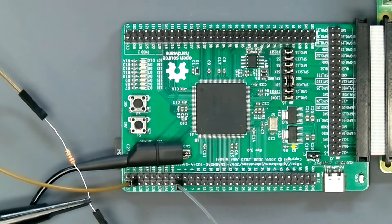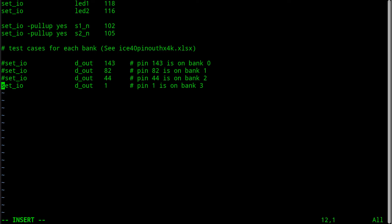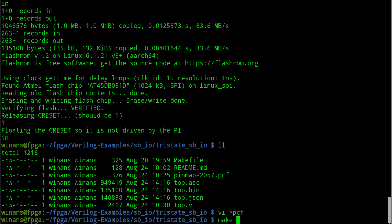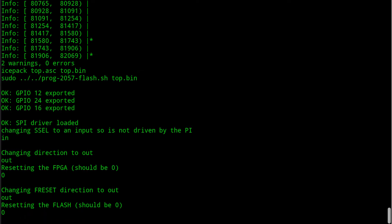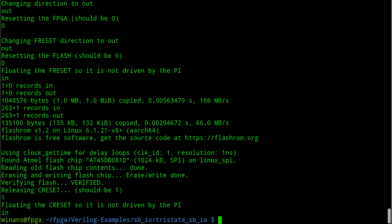But is it driving high or is it being pulled up by a resistor inside the FPGA? If I connect my 33K ohm resistor to ground and look at my scope, I can clearly see a voltage divider — about 1.6 volts, which is halfway to 3.3. So if I have a 33K to ground and inside the FPGA there's a pull-up resistor of 33K going to VCCIO at 3.3 volts, it should show about one and a half volts. This strongly suggests there's a pull-up resistor engaged on that pin with a value close to 33K ohms. If I press S1 it goes to ground; press both buttons it goes high; release S2 it goes back low — high, low, high, low. This is perfect. Then I move to pin 143 in bank zero and run the whole thing again — works the same. Banks three and zero both have the ability to turn on pull-up resistors.